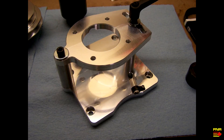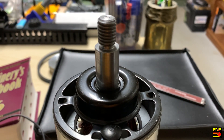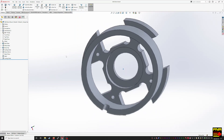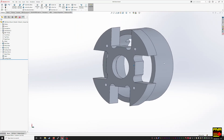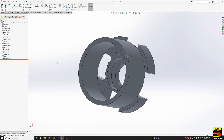Now that we have this kit, the next step is to figure out how to adapt the form factor of the treadmill motor to the form factor of the OEM motor that the kit wants to use. The OEM motor is secured by a square four-bolt pattern, and the treadmill motor is secured by two bolts on the side hanging off a bracket. So we have to make a kind of socket or cup that fits over the end of the treadmill motor, grips it on the outside, provides a tab to lock it down using one of its side motor mounts, and has air passages for cooling airflow. So let's go build it.